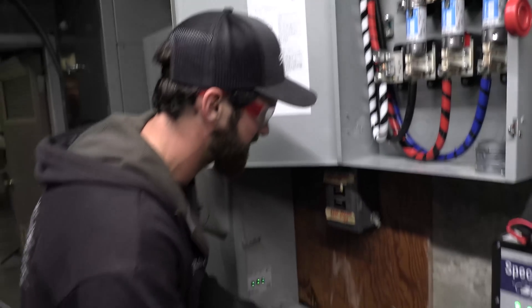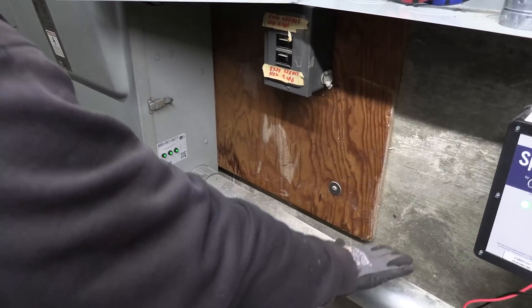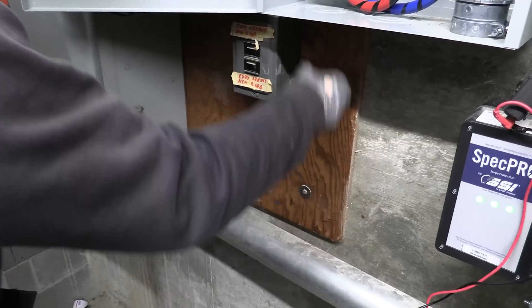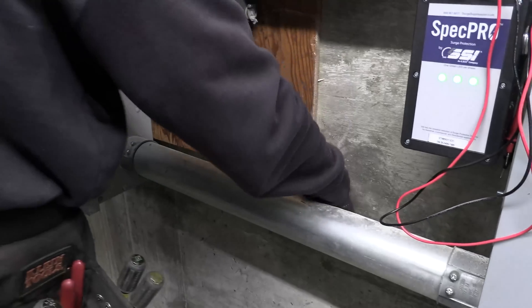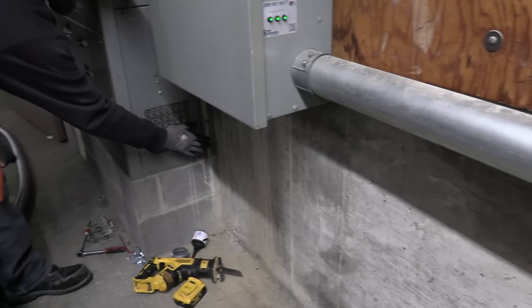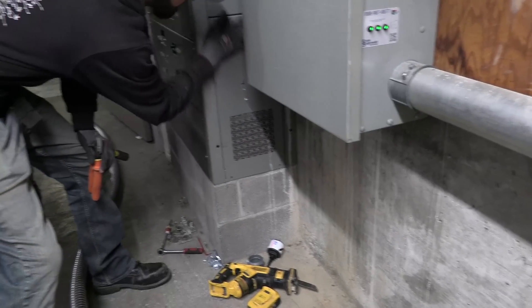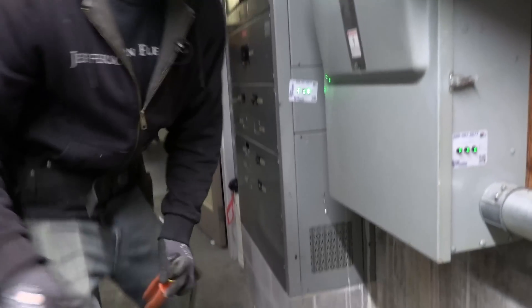I've got obstructions here — plywood on top of concrete — particularly with this three-inch EMT or thin-wall pipe. So I'm going to be using two-inch metal flex, potentially sliding back there depending on the fit, and then coming in the bottom left of this cabinet. I'll take the covers off before I determine my target entry point.